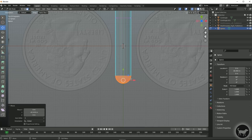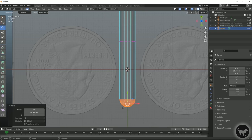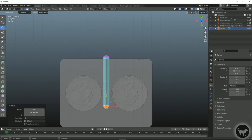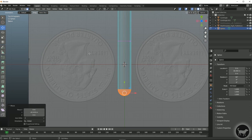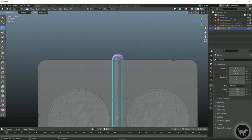You want to make sure you go beyond the section you're injecting into — that's so you have a cold slug well. When the cooler plastic is coming into your mold, the plastic right at the tip of your injection molding machine is usually colder, so it spits the cold plastic all the way to the bottom. Then the only part filling the mold will be the molten plastic.